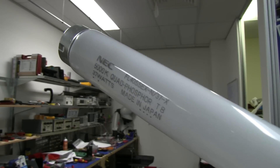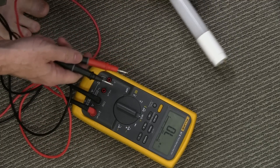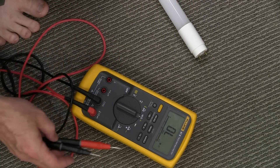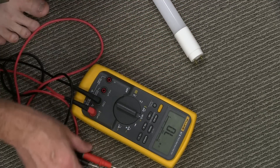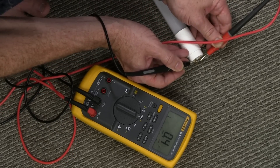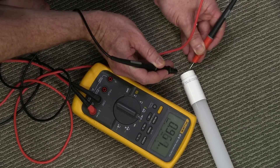For reference, here's the NEC quad phosphor tube — 37 watts not 36 as I thought, 5,000K, made in Japan. We'll also quickly check for safety to see if these LED tubes are correctly designed. I assume they are because you can't legally import the dangerous type anymore — we covered the differences in the previous video. We expect a short on one end only: yes, there's a short on this end, and no short on the other end. That is the safe type.